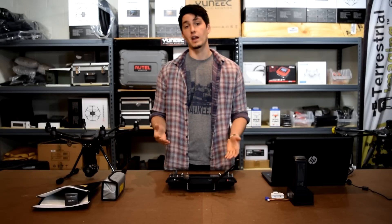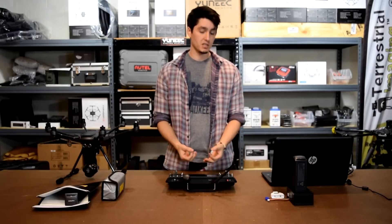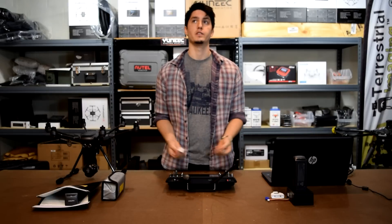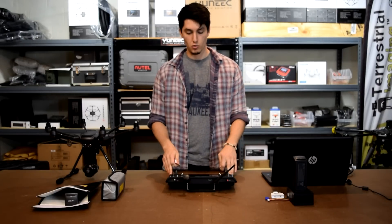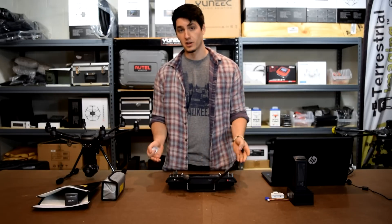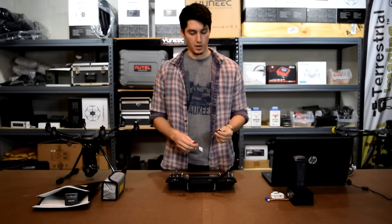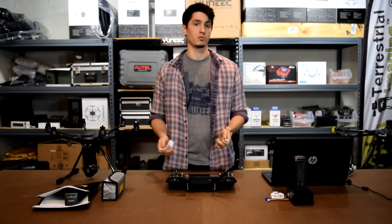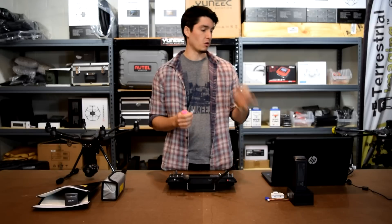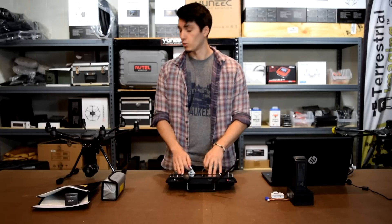Now, there might be different steps out there, and I'm going to be showing you steps that I take that 9 out of 10 times give us a success. Our approach uses microSD cards. Now, I know with the latest firmware — today's January 10th, 2017 — you can use your Wi-Fi to do an over-the-air update. But there are limitations depending on your ST16 battery percentage. I recommend using these chips because it's consistent and you don't need to rely on battery power for your ST16 controller. I'm going to show you how to go to the Yuneec website, find the files, put them onto these cards, and then update your ST16 controller and your Typhoon H.